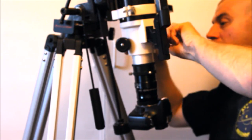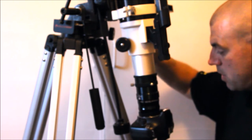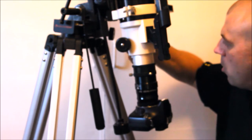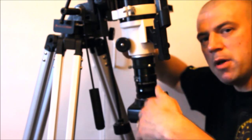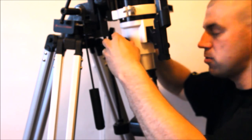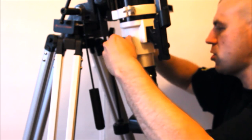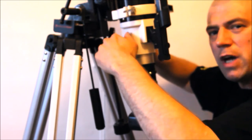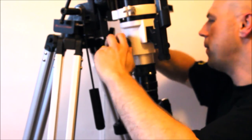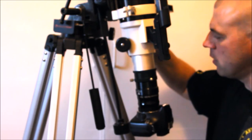Without releasing it, you can feel already a massive improvement all the way down to the draw tube and all the way up. There might be a bit of friction and a bit of roughness, but as you work the grease in and do full extensions of the focus wheel, work that grease in — it takes some time for it to work in. But once it works in and warms up, it will start to get better and better as it goes along. It's already starting to work.